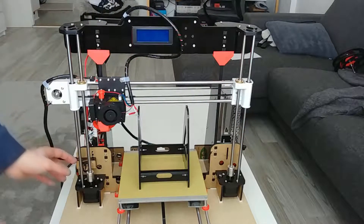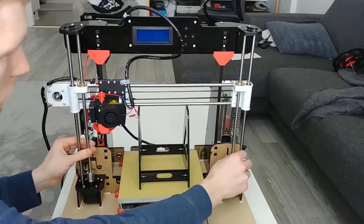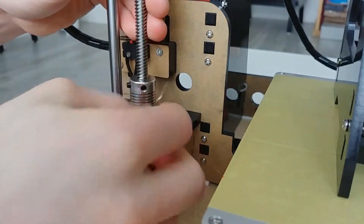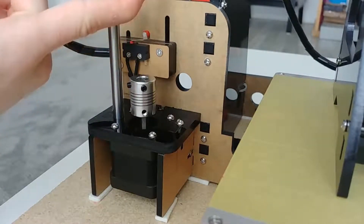The next thing you want to do is raise the carriage up, then power off the printer and lower the carriage to some kind of support. Here is where the filament holder frame becomes handy. When the carriage is supported, undo the screws holding the lead screws and remove them.